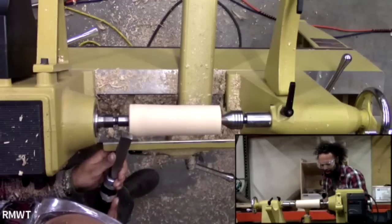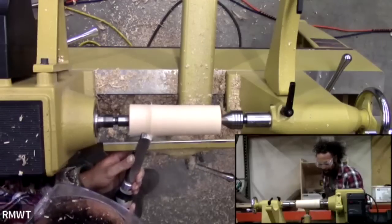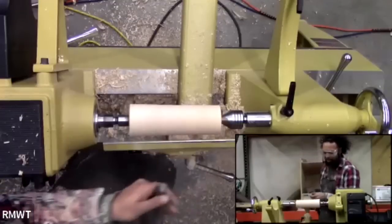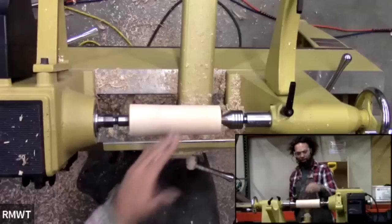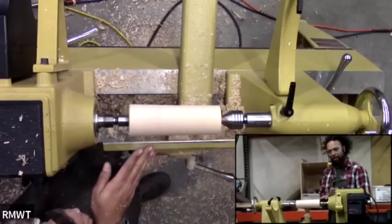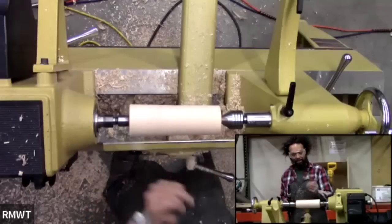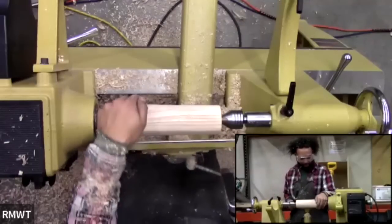Let's chew this up really nicely, leading with the bevel. This is leading with the short point of the tool or the heel. And I'm looking to create as close to a 90 degree cylinder as I can, working with the grain. The fibers are facing 90 degrees. What I can't do is have a situation where I'm going uphill. If that happens, as you saw with the first cut that I made with the skew, if I'm going straight in, well, the direction of the fibers would indicate that I might initially make a really beautiful shear cut going either to the right, this would be my right, your left, or to the left, your right. But if I keep going to the left, that's just going to keep peeling the fibers out. So it's actually a good part for the course to try that out and see. Let's see what we have for a finish right here. Okay, and that's clean. Nice clean surface.